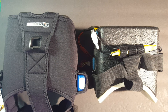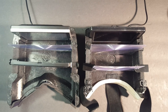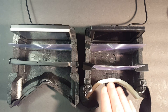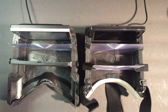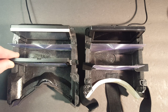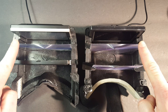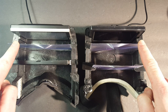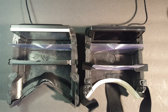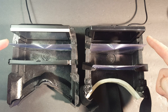The first thing I'm going to do is pop both of these open to show you what it looks like inside. Here we have the inside view of both pairs of goggles — on the left side the V2s, on the right side the V1s. From the factory they both only come with a single fresnel lens to offer some magnification to the screen, but with just the single fresnel lens the picture seems far away and not as immersive as I liked. So I decided to add a second fresnel lens up towards the front of the goggles so that it would double the magnification.